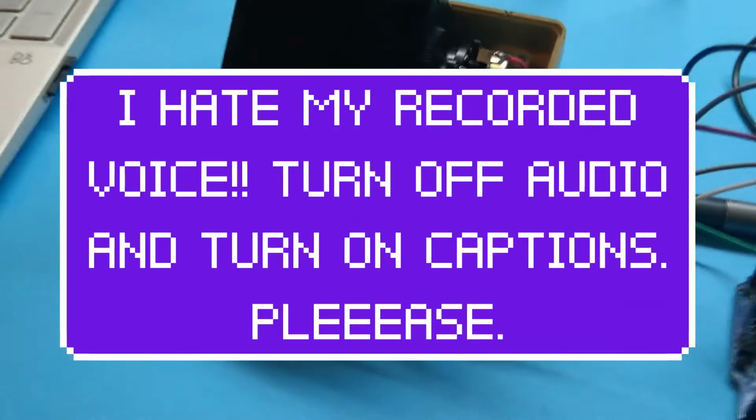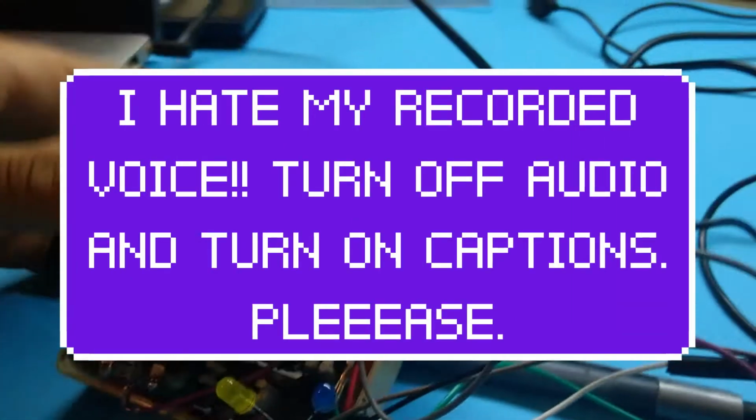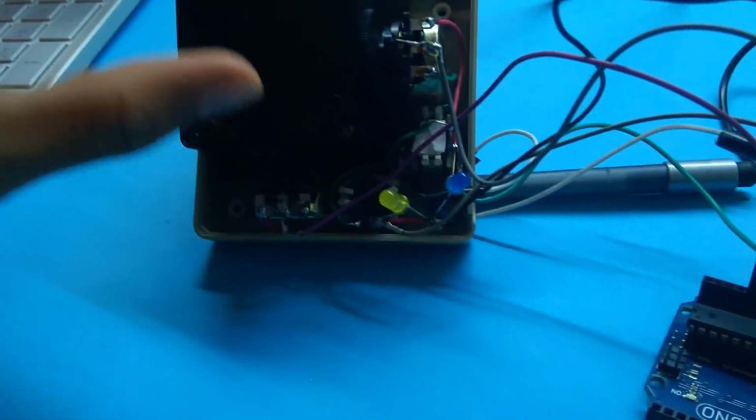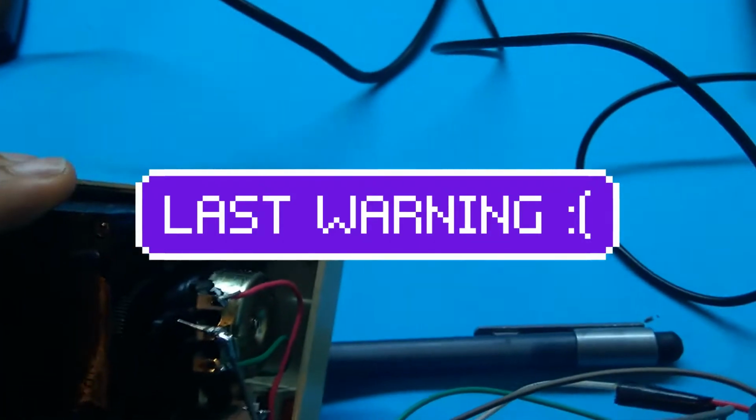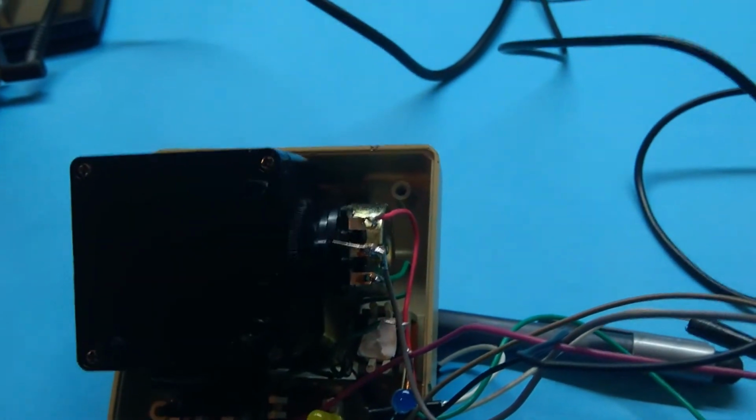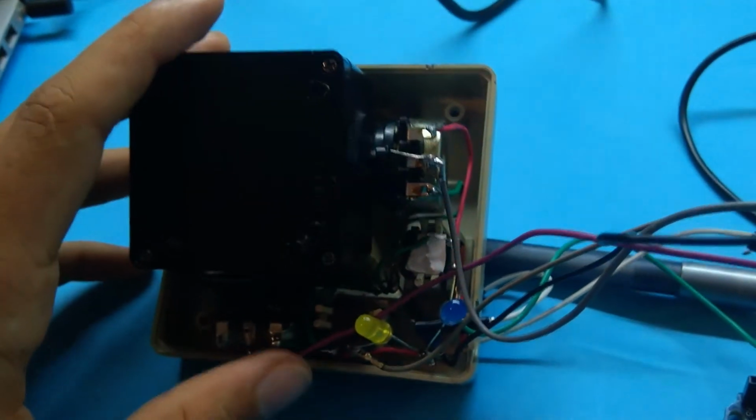So, well, this is the inside of the joystick. You can see that the joystick is here and it connects to the block. In the block, it's got the mechanisms, the springs and everything, which will hold it in its central position, and which will also move the potentiometers on the side here and down here. The potentiometers, obviously, have 3 pins: live, ground, and then the one which goes to the analog pin.